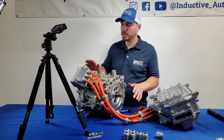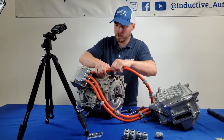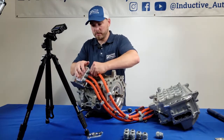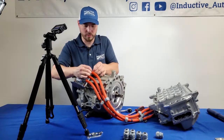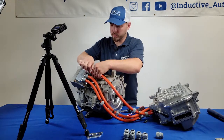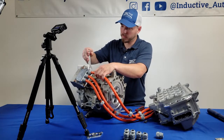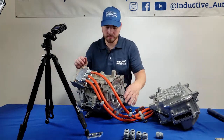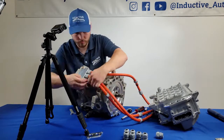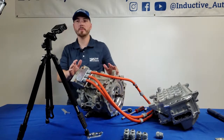After that we'll put our motor side cover plate back on. Last step on the motor side is to fully assemble our cord grips. First, slide the rubber seal down — it can be a little tricky with the larger wire. Work it around to get it firmly in place in the cord grip, get it nice and snug, then install the cord grip top. Screw this on and use a wrench to snug it down. Repeat that step on the other two cord grips. That wraps it up on the motor side.